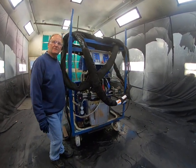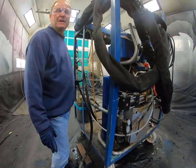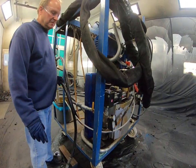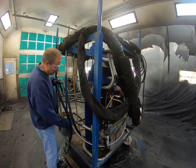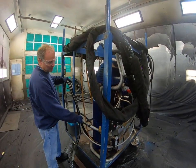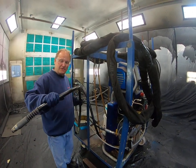We checked the white strainer. The white strainer was clean by that customer, but we still had a material flow problem, and so we grabbed the hose that's feeding from the transfer pump to the white strainer, and we could tell it was very stiff.